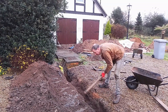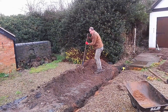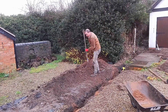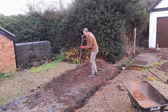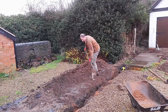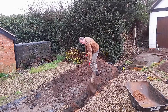I'm really looking forward to getting my drive back. If you're going to dig a trench for an electrical cable on your own, don't break your back — do it over a period of days or even weeks. But don't leave it too long, because if you're digging a deep trench and you have any significant weather, it can collapse and you'll end up doing the work twice.